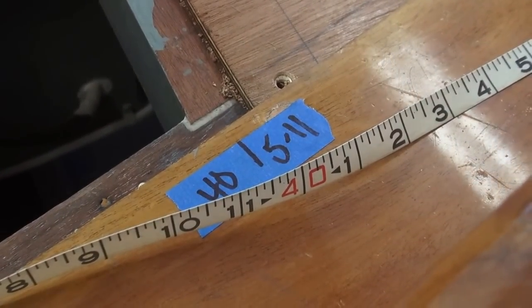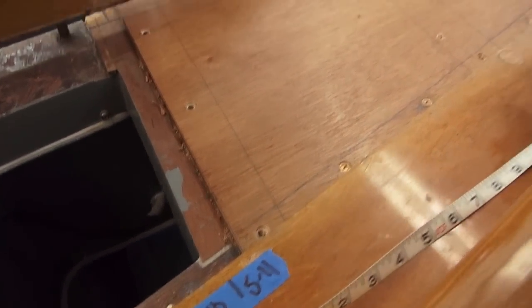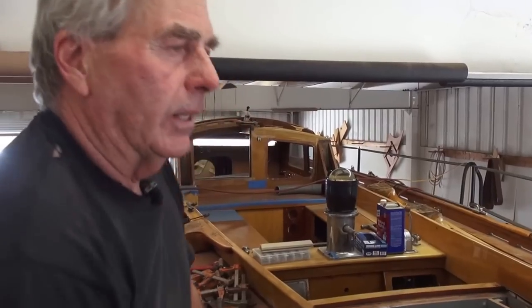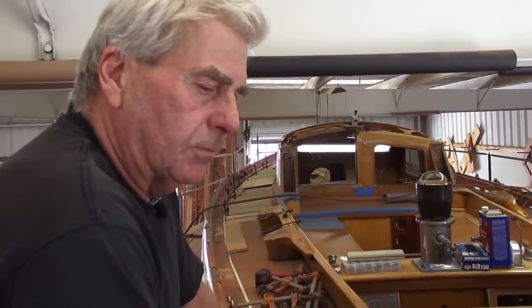We've laid out this 50-foot tape for our plank schedule and we've marked it with tape every five feet, all the way along the margin board — so there's no guesswork. It's 40 feet to the bow from here and 5 foot 11 to the stern right here. We'll number the frames so that when we're on either side of the cabin we can talk to each other frame by frame, just like we did on the hull. You want them to pan out the same on both sides — it saves a lot of layout. And you'd like the back to come in even. If you're on that side deck you can't see this deck, so if we have a butt that's two frames off one side and the other, it makes no difference structurally. It's kind of like hull planking — you make all the planks the same on each side.